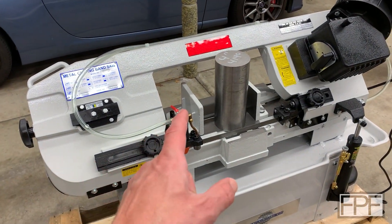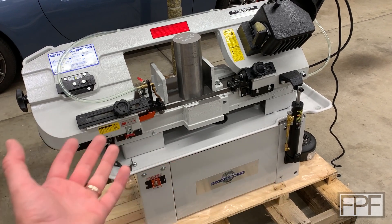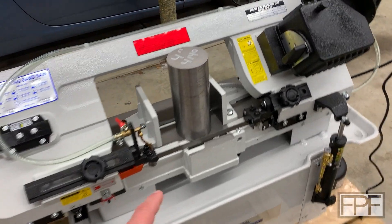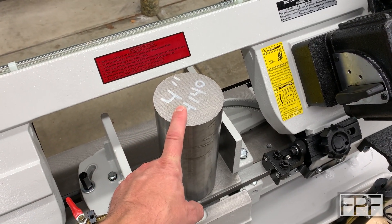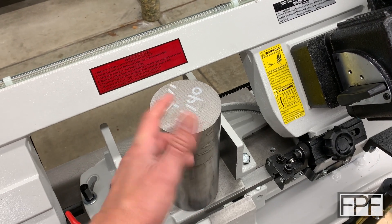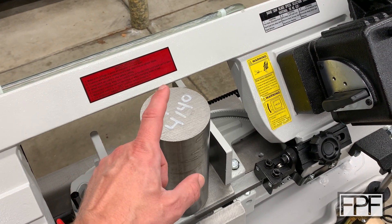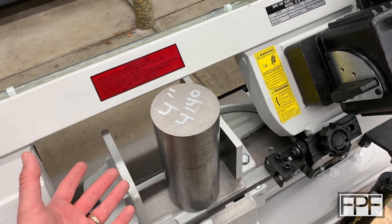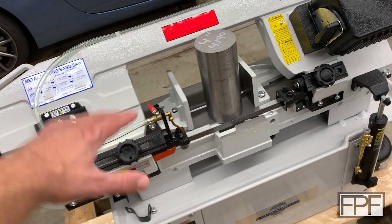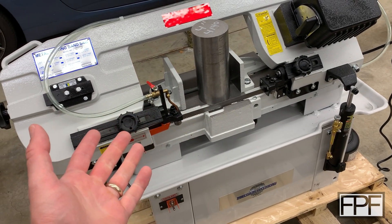So I picked up a new tool for the shop. This is a horizontal band saw and I actually put this purchase off for a while because A, they cost money, and B, I really wasn't sure where I'm gonna put it. But it was time to get it because the pieces of stock I've been buying for lathe projects just keeps getting bigger and bigger. This four inch piece of solid 4140 is a perfect example of that. You could cut it with an angle grinder if you were patient enough and didn't care about wasting expensive material. I can also cut this in my vertical band saw, but it takes an eternity and you're standing at the saw pushing on it the whole time. This saw, I can lay this piece of round bar in here — it's gravity fed with a hydraulic cylinder — and it just does it for you, and you end up with nice parallel cut faces that you can put right into the lathe.